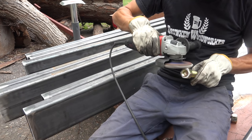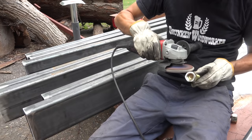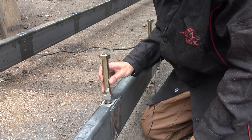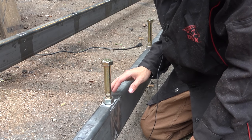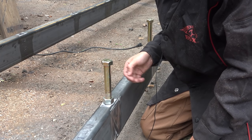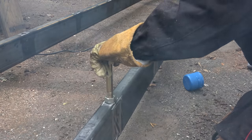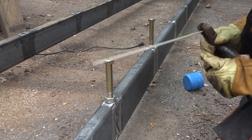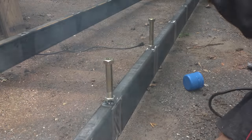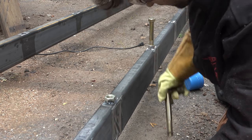While I'm over here, I'll use the grinder to also remove the plating from the nuts. I'm going to start welding the nuts in place and feed the bolt through the nut so I can set the whole thing down into the hole and tack it in place. Then I can remove the bolt and I'll know the nut's in the right position so that the bolt can pass through the nut into the hole beneath it. I'm going to be pretty conservative with the welding here because I don't want to put a lot of heat into this piece of tube — I don't want it to distort at all. I need these things to stay as flat and straight as possible to become the frame.